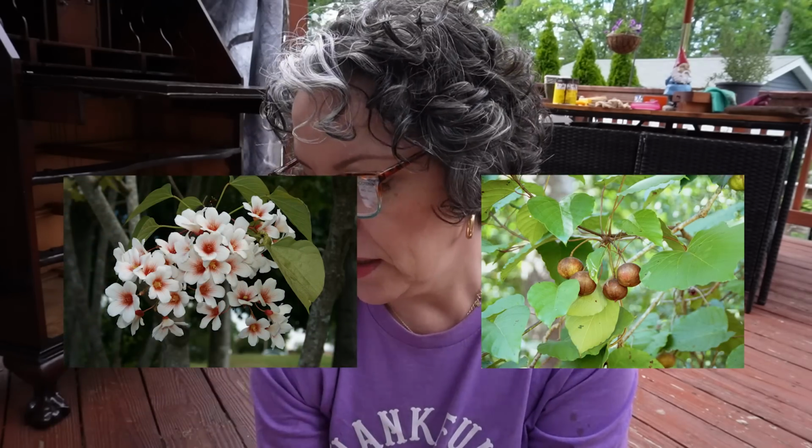So I'm back, and it's actually Sunday. I'm going to start with the Tung Oil. So why Tung Oil and not regular varnish? Tung Oil comes from, I think it's either a seed or some kind of plant in China, and it's easy to apply, but it requires a lot of time in between coats, and you don't have to sand in between coats. When you do the regular polyurethane or whatever, you have to sand lightly in between. This is oil base obviously, and so is my stain. You don't do water base and then Tung Oil, it won't work. They don't mix well together.